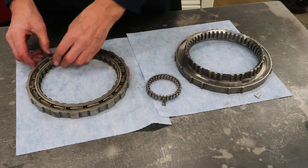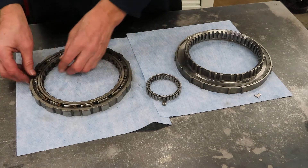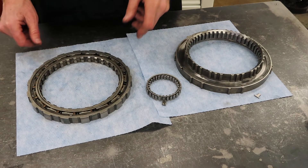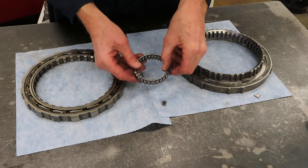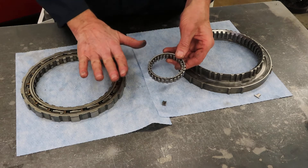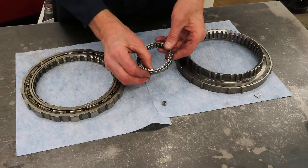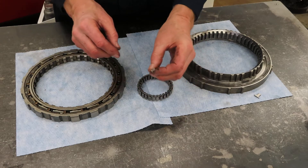That's one of the main purposes of a mechanical one-way clutch — you accelerate and you let off the gas. Now this is a sprag type of mechanical one-way clutch that accomplishes the same thing. I'm not sure why the difference, other than the space requirement — it makes for a much smaller package, and maybe that's the reason these came along.